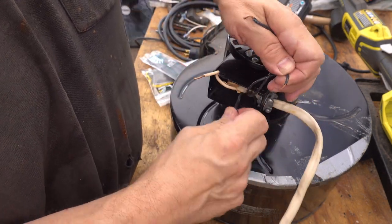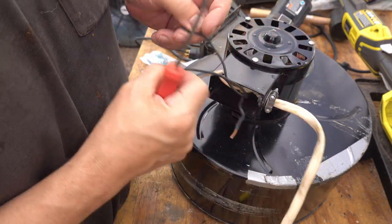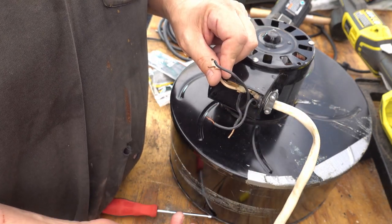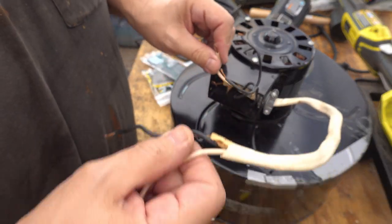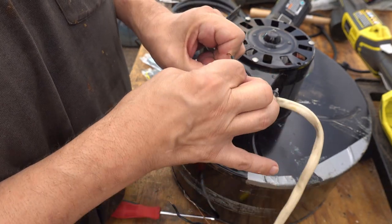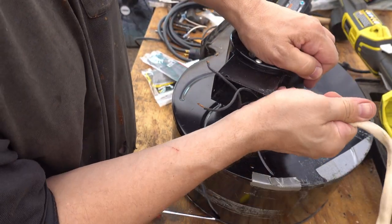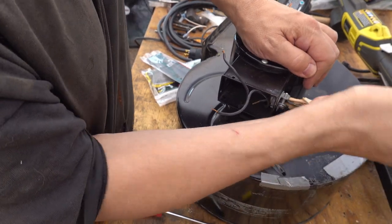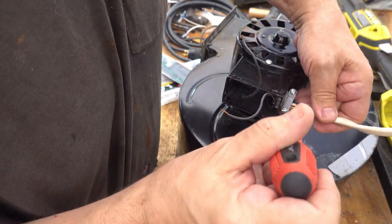The way that this is wired on the motor side, the polarity of the hot and neutral wires don't matter. Just as a bit of normalcy in electrical wiring in the U.S., the black and white wires are normally used for 120-volt plugs. The black wire is generally the hot wire, the white wire is the neutral. That's a convention in most electrical systems throughout the U.S. — I believe it's in the code — and I like to keep to that code, so we're going to do the same thing.